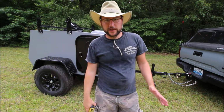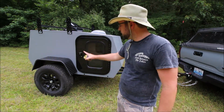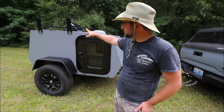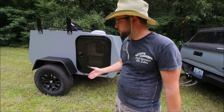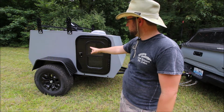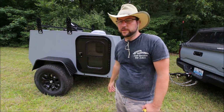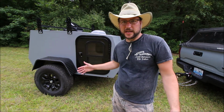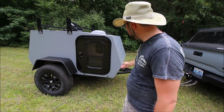That right there is 40 inches. So you can get one side out of a sheet of plywood. I've got 85, 86 here, and then 40 there. So what I did was I started with a full sheet of plywood. I cut 85 inches. I just cut right off the edge, and then I cut the whole length. Right, I just cut 8 inches off the top. So that's what I started out with, and then I measured in a little bit here and made a diagonal in here.